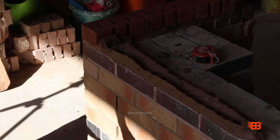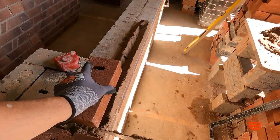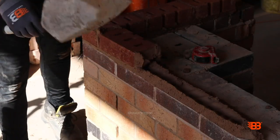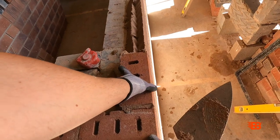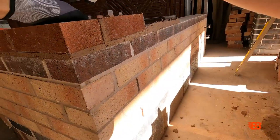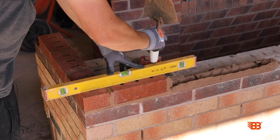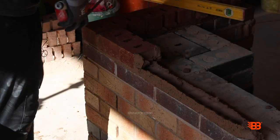Connecting to this corner — I'm laying forwards here now, so I need to put butter to the back of my brick and the front, because that's got no butter on this brick here. As I'm pushing onto that I want to hold it so I'm not pushing it out. Get it down, scrape on the board. It's a little bit big that joint — get over a bit, down to that aris, get my joint parallel. As soon as I think it's okay, get my level on it, get that down first, and then knock it into place. I'm going to check the brick length — which is one and a half, it should be. Needs to go over a bit.